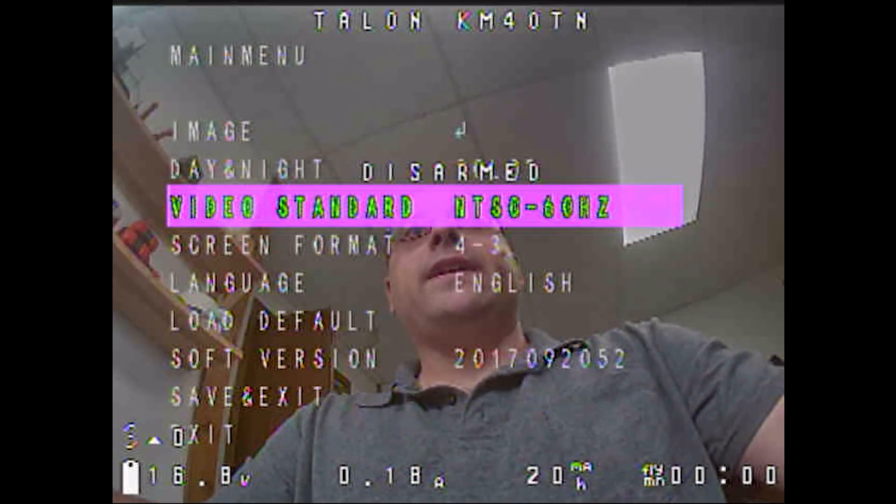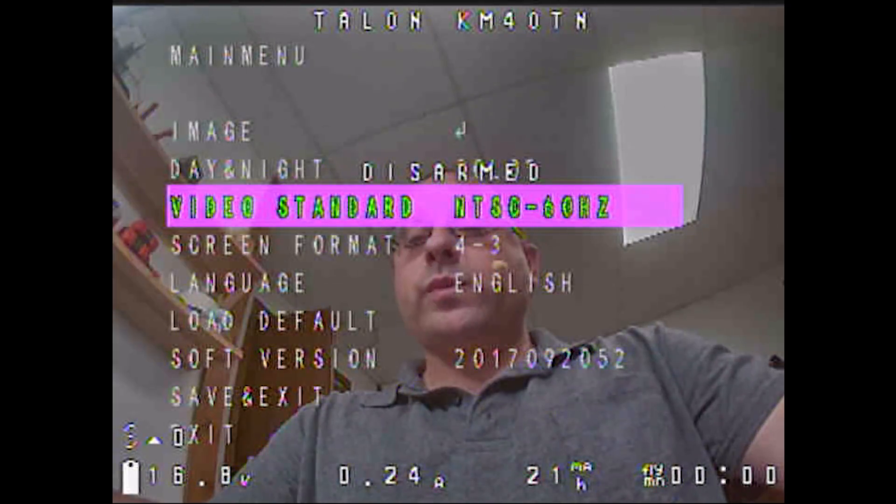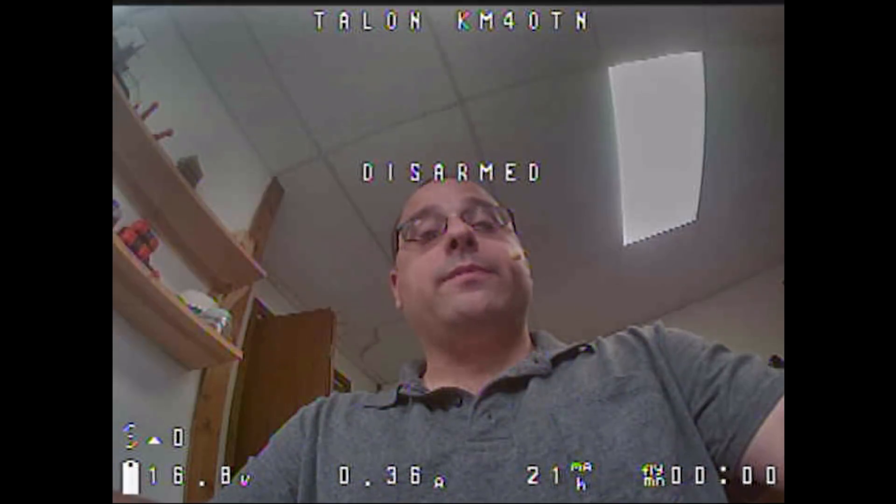Some display devices like LCD screens don't automatically switch or don't like certain formats, so the ability to switch in the menu is nice. The next thing to talk about is that famous white flash issue that occurred on the Runcam Eagle 2. The Eagle 2 had very high nighttime sensitivity with an internal algorithm that when it got dark would boost the gain, making the sensor much more sensitive to light.